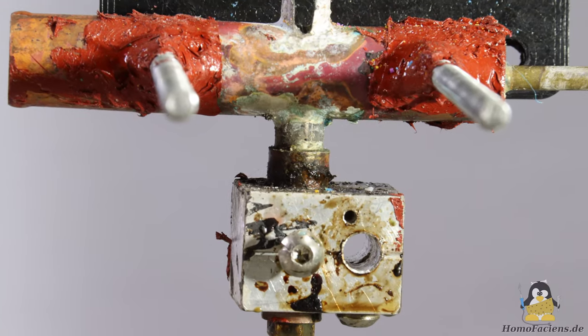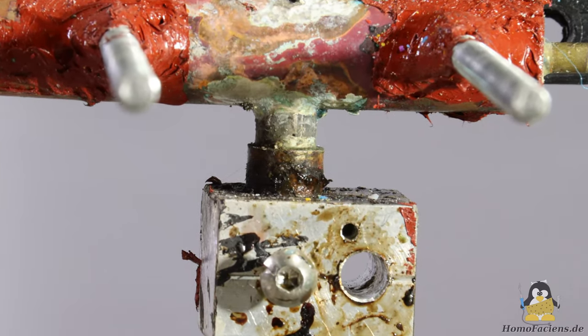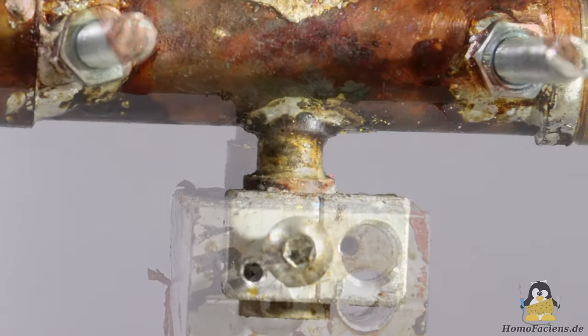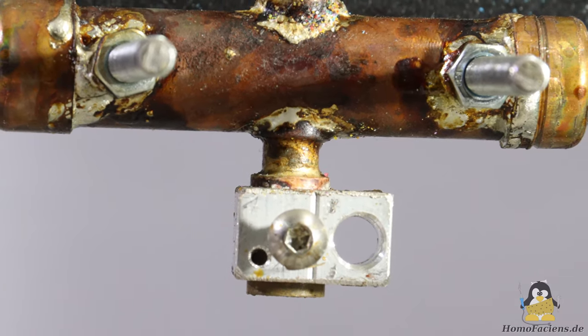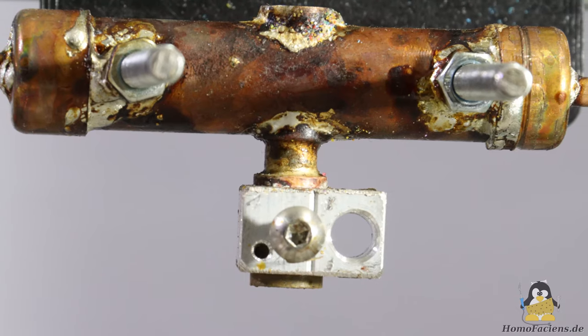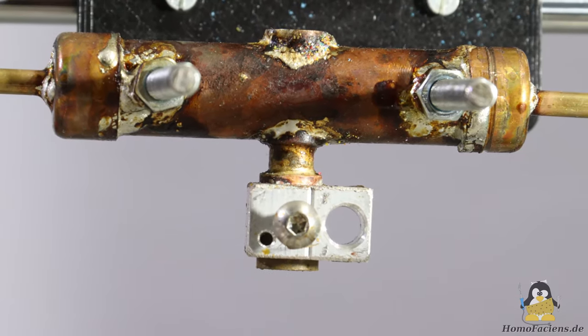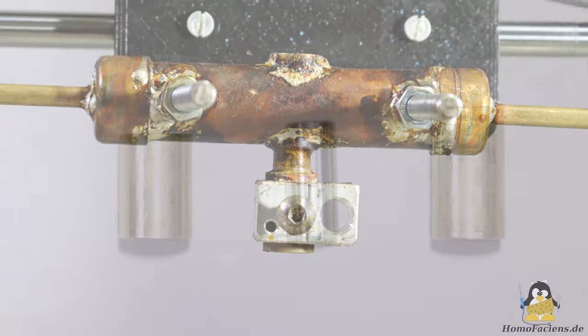The second place where the tube design was reduced is the distance from the hot end to the cold end. The transition from solid to liquid therefore takes place in a smaller volume, which results in less friction on the auger screw and also a smaller force component in the direction of the nozzle. This means the mechanics bend less during extrusion, which leads to quicker response on retract.